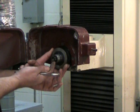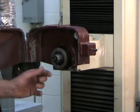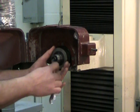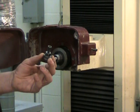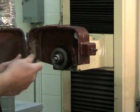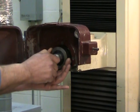This is going to seem pretty easy, but in reality off camera I had to fight with this retaining nut quite a bit, because again after the crunch — since this is a left-hand thread — this nut was really jammed onto the spindle thread. So let's get this nut off. Now that the nut's gone, I can install a puller that's going to pull this tapered flange from the spindle, and once again I expect this to be seized up.